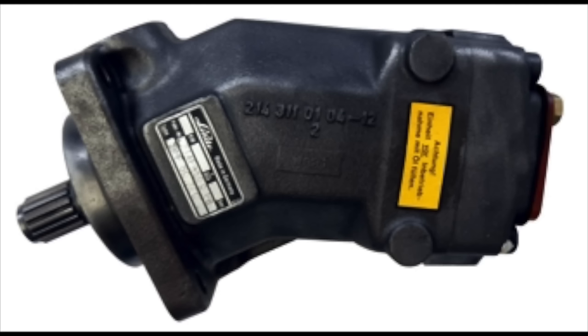So that's what caused the winch to be oversized, which caused it to be some sort of special thing. So you typically have on the side of the winch a hydraulic motor, and you have a hydraulic pump that's turned by an electric motor. But if that pump turns another motor, it's just a pump at that point in time. But if it turns another pump with nothing else, that's a motor at that point in time. It's kind of the same thing, because hydraulics just do the same thing on both sides.